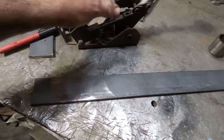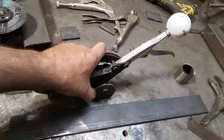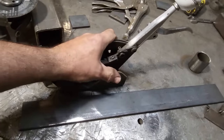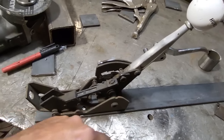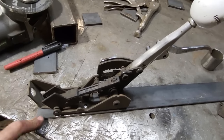And it's always better. I've seen these in cars and they're always rickety and you can move them back and forth like this. And I hate that, right? I want this solid in the car and want to have it so that it's not going to move. So that's how I'm going to do it. So I'm going to go ahead now, cut this off, drill out them few holes there and get them tapped and get ready to weld that piece back in the car.